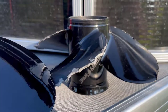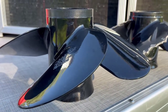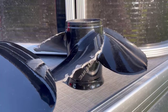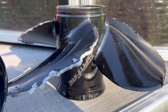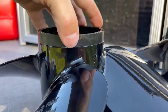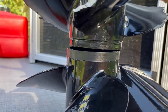The 11-pitch is going to give me a better hole shot — how quick the boat pulls as I take off — and that's going to give me more instant torque. The 13-pitch should theoretically give me more speed once I'm up and moving. I'm towing little kids, so I'm hoping for a little bit more speed, recognizing I'm not going to have the same oomph as the 13.8 by 11 when I kick things off. So I'm going to try this 14 by 13 versus the approximately 14 by 11. I do have another 14 by 11 as well — I picked up two props — but I'm going to test this one out.